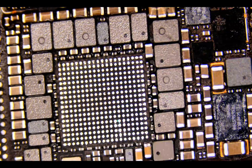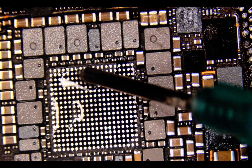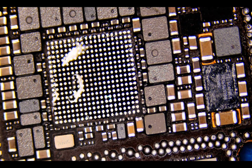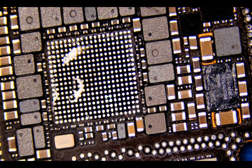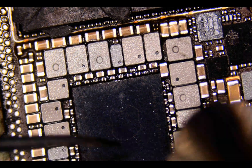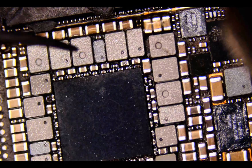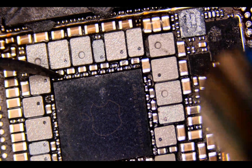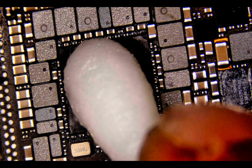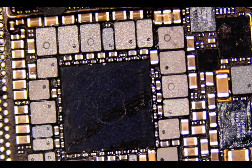Let's apply the Power IC and get it back, then check the result. Apply it with the correct direction — yes, correct — with temperature 385 and air 60. Get it back. That's done. Now check the result, check the milliamp reading.